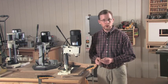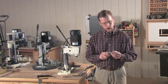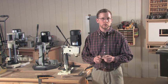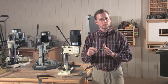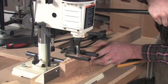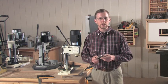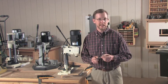I'll show you how to set up the machine and cut a mortise, but before I do that, I want to talk a little more about the dynamics of this bit. In order for these bits to work properly, the auger bit has to go into the workpiece first — it clears out most of the waste. The chisels follow behind, squaring up the walls of the cut and clearing out the rest of the waste on the bottom. That auger bit needs to be out ahead of the chisel, and you need to leave some clearance space between the auger bit and the chisel. That clearance space enables the bit to draw chips up out of the cut and eject them through a slot on the front of the chisel. The amount of clearance will vary based on the power of the machine, the sharpness of the bit, and the density and type of wood you're cutting. The space can be anywhere from a sixteenth of an inch to three sixteenths of an inch, so try it on some sample test stock to see how well it cuts.